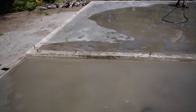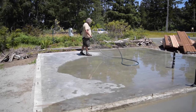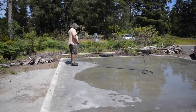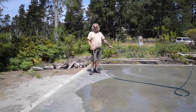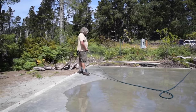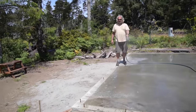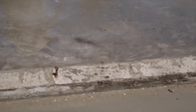Right now the slabs are wet because they're curing. We keep them wet so they slow-cure and they don't crack in the sun, because I spent a little money on this. We've got about 18.5 yards of concrete at 4,000 pounds per yard — we are not going to blow away, it's pretty heavy. And then we're going to bolt the house to it. You can see these bolts sticking out of the wall — the wall is going to sit right out here. We'll bolt the plate to the bottom of the wall onto the slab here, the stem wall.